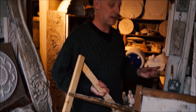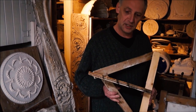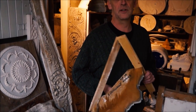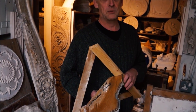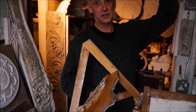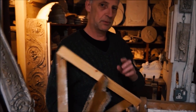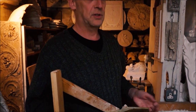What I've been telling you up to now was casting, primarily enrichments for putting into a cornice. The next bit is making the actual cornice itself. The first thing you've got to do is get the profile of the cornice you're going to make. If it's a restoration, we'd either cut a bit of it down and draw around it, or make what's called a squeeze — where we oil the cornice and push up a lump of plaster of Paris. Once it's set and taken down, it's got the profile of the cornice and you can draw around it. For a new cornice, an architect would just give you a piece of paper with a profile drawn on it.